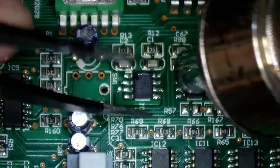There's no components. Wow, I'm pinching the board. It's coming back on and off. It could be a bad wire, but I don't know. I've had them before, quite rare. And something this clean as well. Oh, do you know what? It's this resistor. I think this resistor's dodgy. Or at least the soldering of it is dodgy.